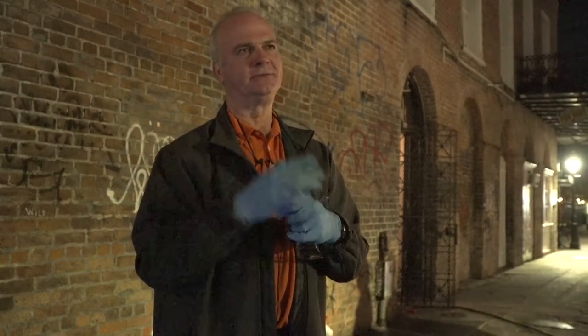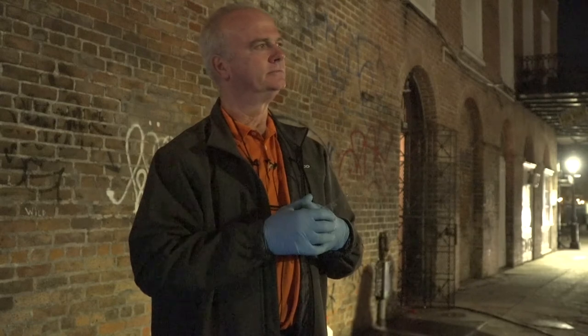Would it ever be necessary to then come back with a second pass, or you would just do that? No, most of the time, two will do it. For water repellents. If you've got an extremely tough graffiti climate, you might want to put a third coat on for good measure, just to build it up more. That is buildable, right? You can build mils with that coat if you really want to. Yeah, you could, but we don't want to, because when you build mils, you lower the perm rating. Yep, that was the point of my question.